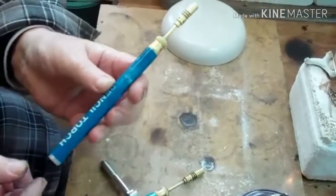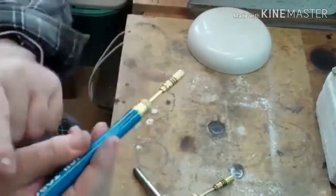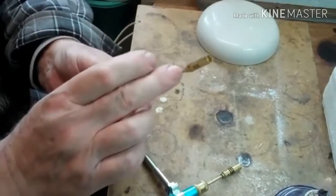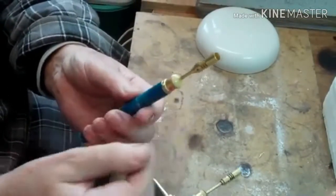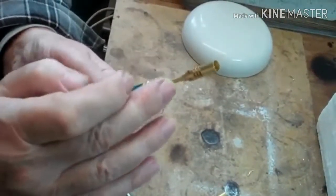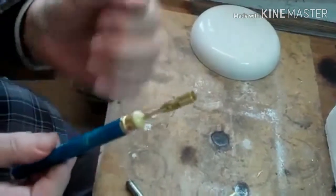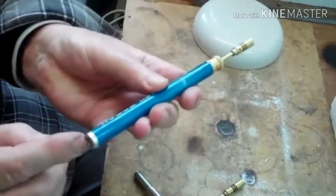There's two things that are left that can be improved. One is the small capacity of the torch itself, with the integrated design of fuel tank and neck, and the other is the close proximity of the liquid fuel to the small diameter neck, where as the fuel vaporizes as you turn it on, the bubbles allow liquid fuel to come up into the neck, and gradually the liquid fuel and any contaminants reach the jet and the thing dies down. And this is the real bugbear with these things, and this is the subject of most of their bad press, that they start dying on you as soon as you've filled it up.